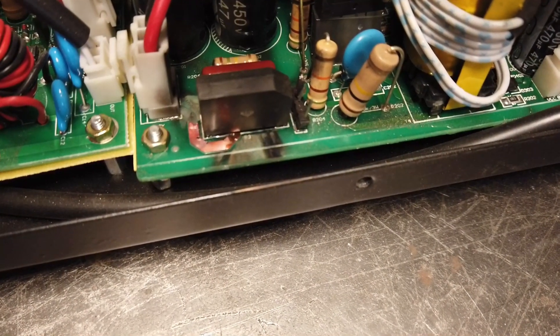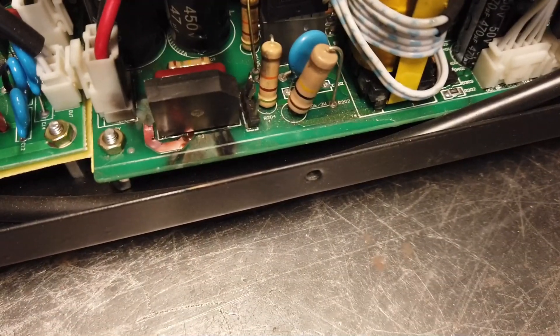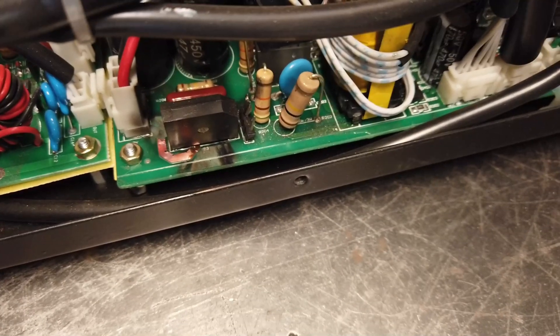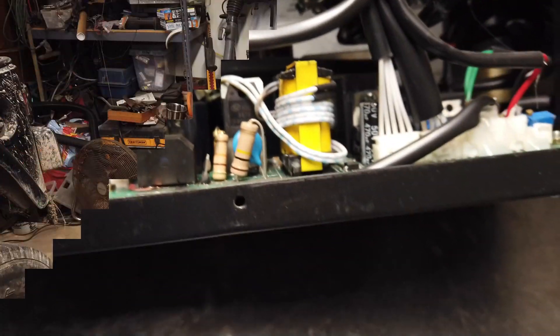I can't really see any numbers on what this is, so I'll have to dig in a little bit more. I'm going to take a picture of that part of the board and show the Sungold Power folks. I don't know which board they consider to be the high-frequency board, but they already quoted me $59 for it. That's a lot of componentry on that little board. I don't see anything else in here that looks amiss — these MOSFETs all look okay to me, they don't look popped or cracked.